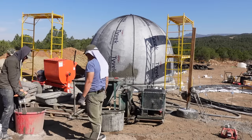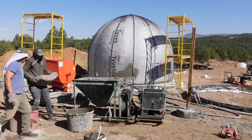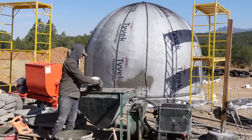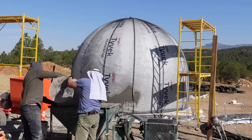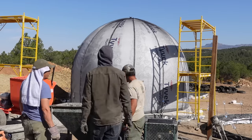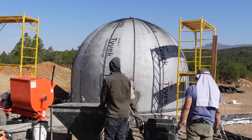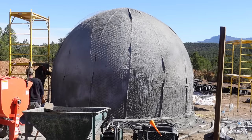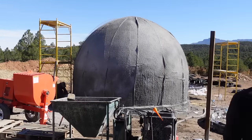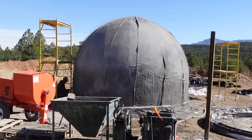You won't see this process in this video, but I spray cement onto this mesh. The cement is a special mix I've been developing — I call it latex cement. It has a few ingredients I won't get into right now, but when mixed up it gives you a waterproof, super-strong cement. The whole idea is to build a thin-shelled dome that's super strong because it's reinforced. The first reinforcing layer is the fiberglass mesh, and then we put about a quarter inch of latex cement onto that.